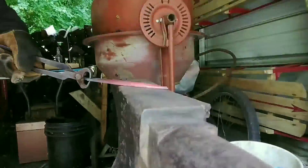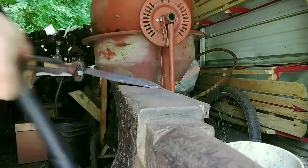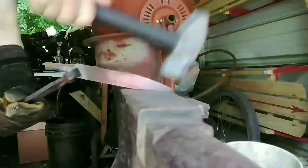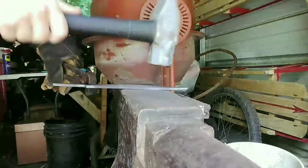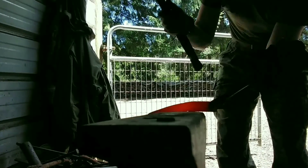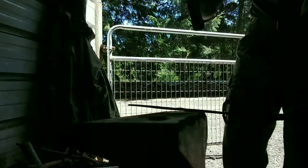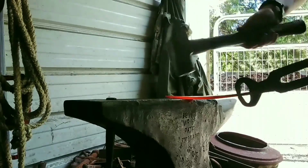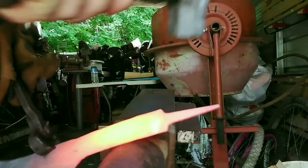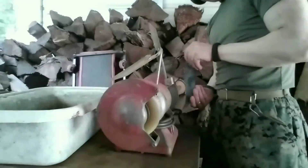First I put in the tip — as always with forging any blade, you always put on the tip first. My issue right there was I hooked the tang and screwed up the top bevel. Now it looks more like a regular single-edge blade. I got pretty mad, so I'm just going to forge it into a single-edge blade, but this also poses an issue you'll see up ahead.